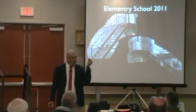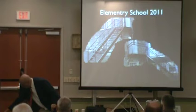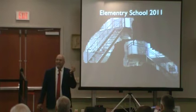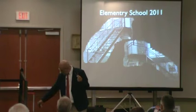Oh, by the way, don't forget the orange paint is lead paint. Today, can we weld or burn anything with lead? The EPA will give you a $37,500 fine. 99.7% of every fire escape in the U.S. ever built was made with rivets and bolts, never welds. Welds don't last long on most fire escapes.